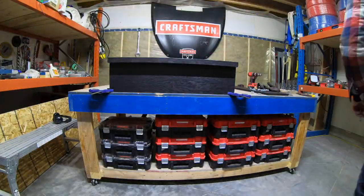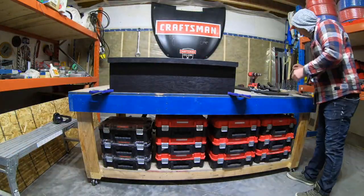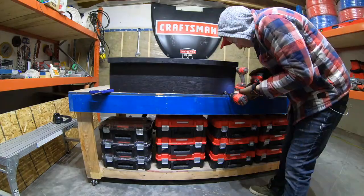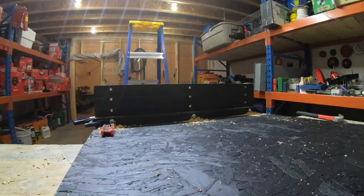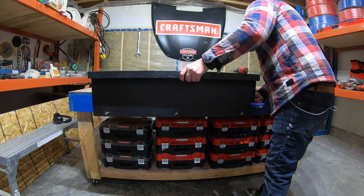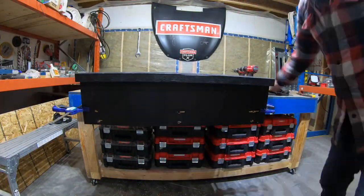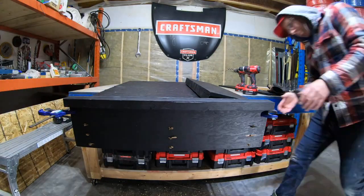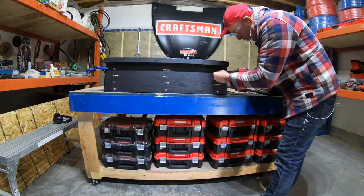Mark out bolt pattern 3 inches in on each side and 1 in the center. Up 3/4 inch and it will be center of the 2x2 behind. Clamp and drill holes. Lower side piece 2 inches and drill through the back this time. This will make sure of perfect alignment for all the 4 levels. Too bad about the plywood blowout, but I'll just touch that up with some paint when I'm finished off.